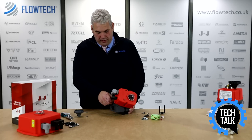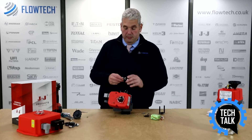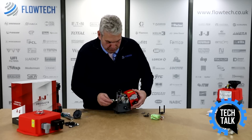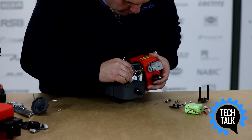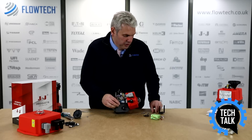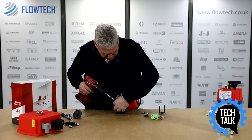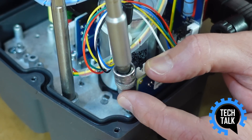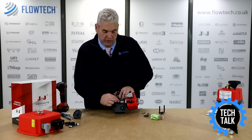Once you've removed the cover you can leave the cover connected. We start by installing the new PCB into the actuator. This is done in the far back right corner. You'll see inside here that the male part slots into the female part, and then you have a securing screw which holds this in place. That's now secured in place nice and firmly.